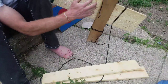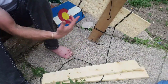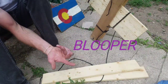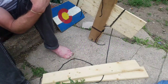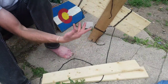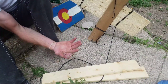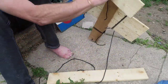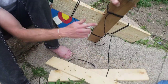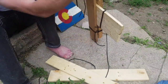So once you have all four knots securely tied it's gonna be really sturdy and hold there. We're gonna let it go overnight before we move on. Now that we've got all four spots tightened down, it's just gonna hold it nice and secure until it dries. According to the bottle it takes about 30 minutes to bond, so we'll let it go for 30 minutes. Then we'll add the next board — exact same process, putting glue on both surfaces and putting it together — but we're gonna take off these two side bindings and put them around all of them.